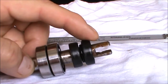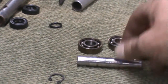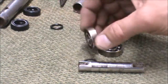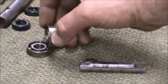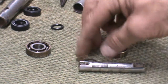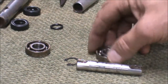I was interested in the water seal and the oil seal and also just in a feel of the bearings to see how they've held up after 1200 hours. Here you can see I've removed the bearings. One of those bearings did have quite a grindy feel to it so I will be replacing those. Those bearings have a circlip that sits in between the two of them so you can't just push both bearings off in one direction. One needs to go off one way and the other needs to go off the other way. That circlip's a little trap for young players that might not have known about it, like myself.